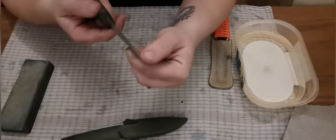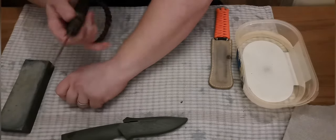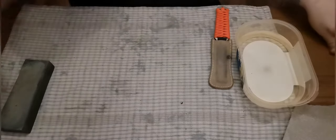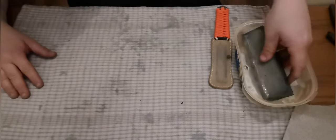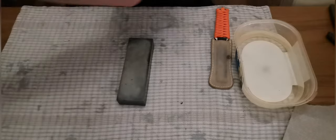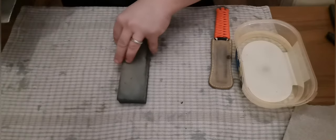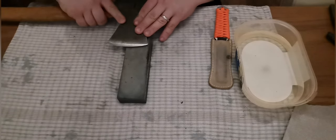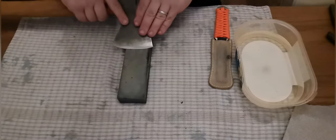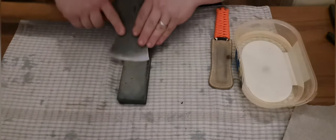I can feel the difference - that is much sharper than what it was before I started to sharpen it. It does actually take the hair off my arm, but I don't feel the need for it to be that sharp. Knife done, set that aside. Get the whetstone back into the water to absorb a little bit more. Take my axe - now the same principles apply when sharpening an axe as with the knife. Flat down like that, lift the axe - see the tilt there? You tilt it till you find that bite, where you find that angle. You're just pushing the axe away from you, not tilting it too much where you're digging the blade in - just till you feel that bite and pushing it forward.